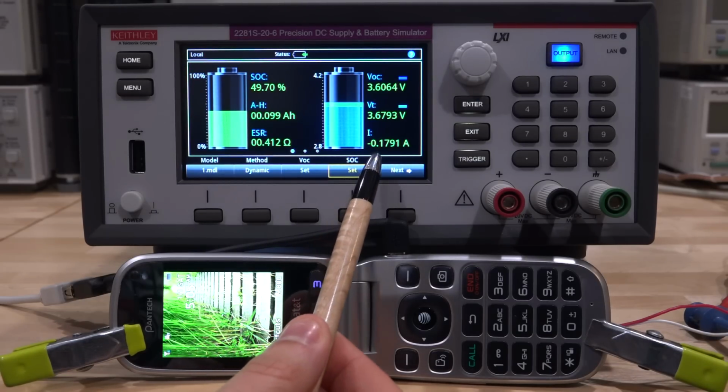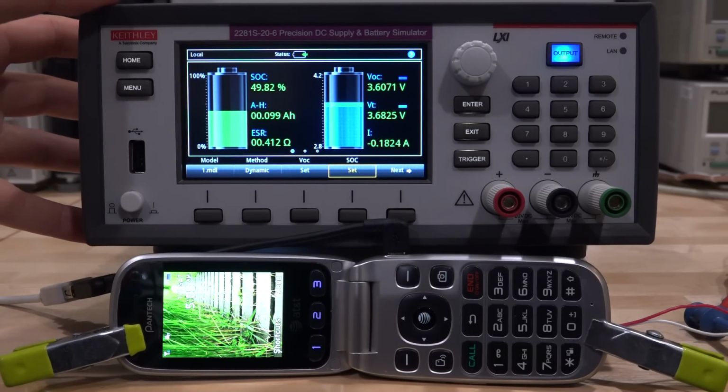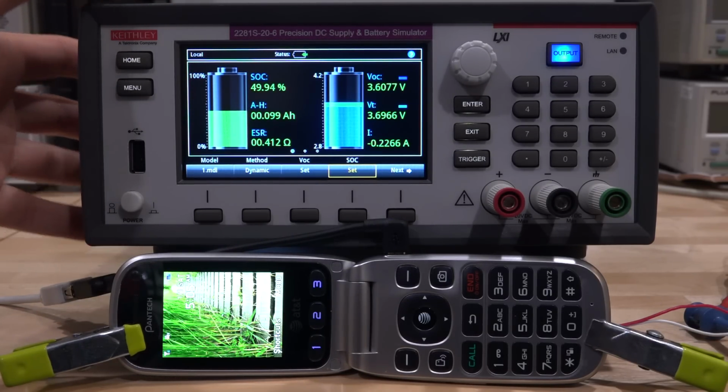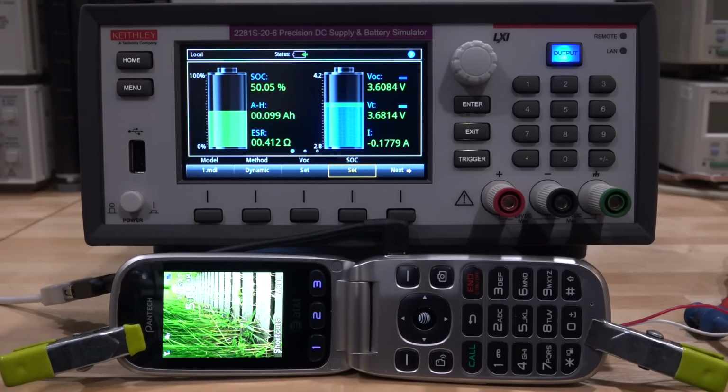Now the maximum current you can charge the battery is set to the maximum current this guy can accept, which is 1.25 amps. But this is a very large amount of current, so you can charge a lot of different batteries using that system, and this is why it's so important for this instrument to be 2-quadrant, even though it does have that limitation of the maximum current.